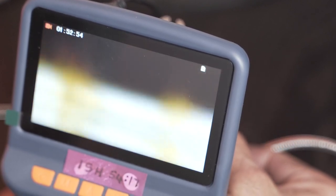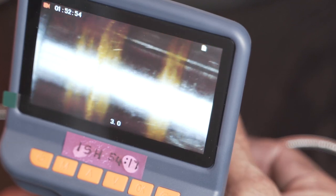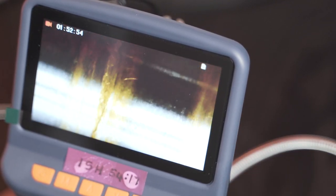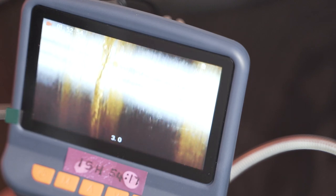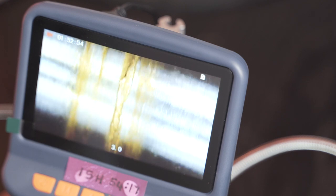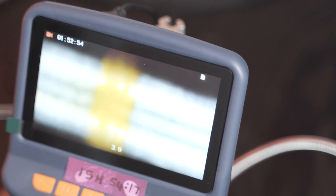All right, here we go, guys. So this is what we term material transfer. That's the steel shaft right next to where the piston ring is, where my finger is. I've just taken the ring out, the air oil separator, sorry, not the piston ring. Have a look at the bronze material that has impregnated itself into the surface of the shaft. Can you see how that has melted its way onto the surface of the shaft? Really, really interesting.